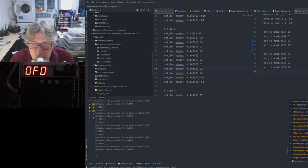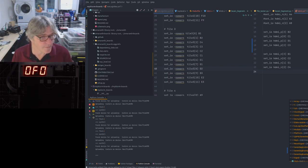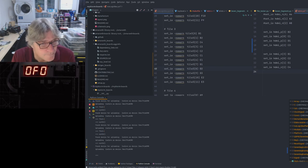Yeah, so we need to have a think about what we put in the audio tile. I did find a relatively low cost codec at some point, but getting hold of them can be difficult, just like anything else chip wise. AL London says solar panel plus battery management module tile. Yeah, well, we can look at all of the more industrial stuff. Can work on some tiles for that, but yeah, battery management and battery powered. If you want to go the solar panel route, then we could put an MPPT on a tile as well as part of the battery management to make it more efficient.